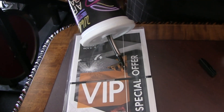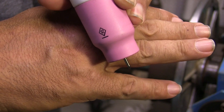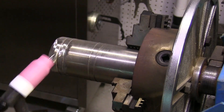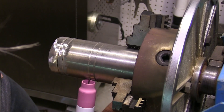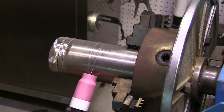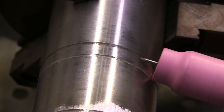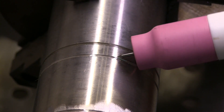There's some leeway — you can go a little further or run it back in; a lot of that is personal preference, you'll figure it out as you practice different electrode extensions. Here's a little exercise in walking the cup. There's the number 12 cup again. Now I'm going to show some previous clips where I put a round piece in here with hash marks scored like the edges of a pipe bevel. You can see walking it in a sort of figure eight — if you've ever walked a metal drum across the shop floor, it's really the same thing, except now you're holding on to a torch handle instead of the top of the drum.